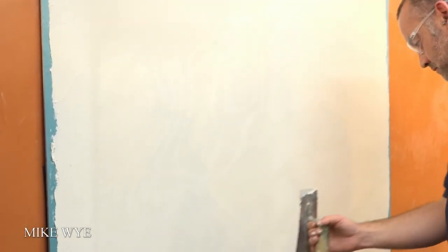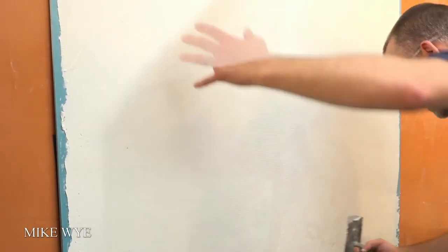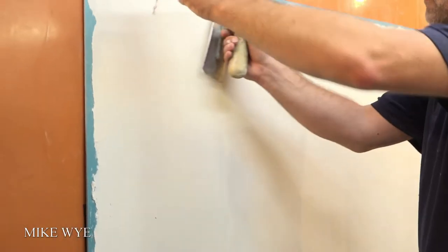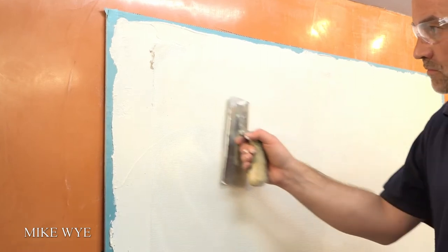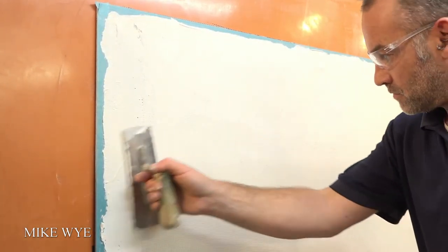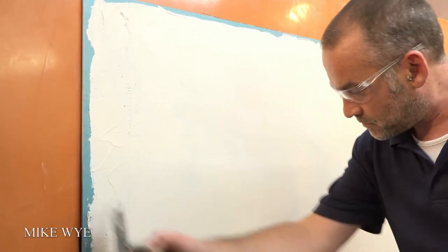The different grades of lime wall finish are finished differently. If you're doing a thin coat Venetian plaster like the Stucco Fine, you want to use the smooth lime wall finish and you want a nice, clean, flat finish. Once it's dried, it can be sanded to remove any lumps because these will be visible through the finished plaster.